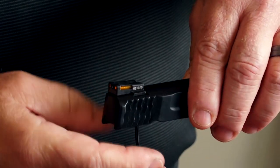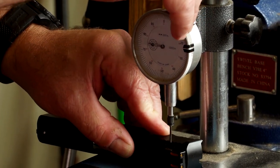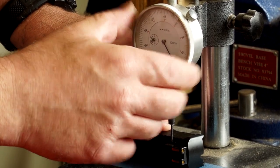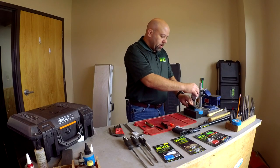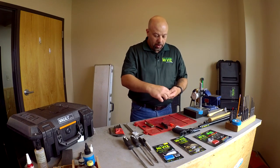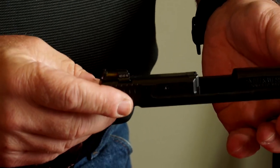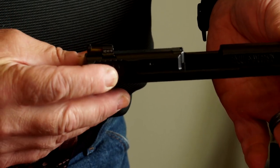This particular sight has a slot in the slide where the retainer screw goes, so you can adjust it side to side. I'm going to use the dial indicator — I'll go to one side of the sight base, zero my indicator, and then flip it over and check the other side. I'm 1 thousandth off center, that's pretty good for a guess. We're going to leave it there and tighten the retainer screw down. The factory screw has a thread lock patch on it, so there's no need for any extra thread locker — and that's all there is for the rear sight. That's an easy installation as handgun sights go.